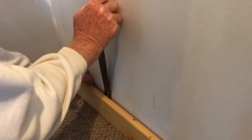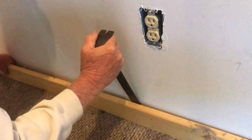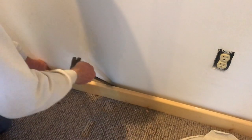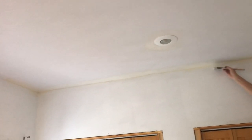Removing the trim is not as difficult as you might think. A thin crowbar gets behind there and you just loosen it up. Then once you get the trim off, all you have to do is tap the nails back a little bit. When the painting's done, you pop it back in and it's really clean — these are the details that make everything pop.